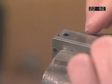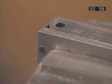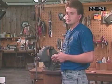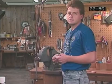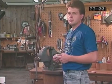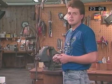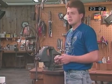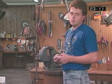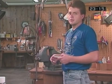And we'll use a feeler gauge in between this to keep everything going straight. Okay, now we're going to cut a sear nose, and the angle we use is basically a stock Colt sear angle. All we're doing is polishing it up, putting a higher polish on it, keeping the exact same angle that it is. And as you do your trigger job, you may need to back the angle off or give it more angle to suit the gun, depending on what you have from gun to gun.